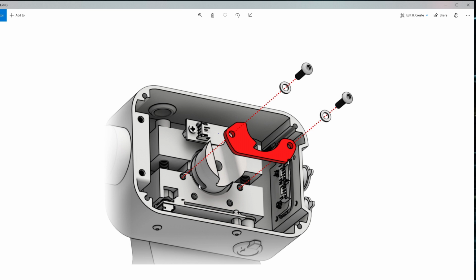So after trying a couple of different cams and having the same problem, I knew it wasn't the cams. I thought there might be something wrong with them. The only other thing I could think of was whether there's something going on with this groove. I got a cotton bud and put it round the groove, backward and forward, and lifted it out. And there were tiny little bits of metal swarf, tiny metal flakes. Once I did that and put the cam back in again, it was all smooth sailing. It was moving freely.